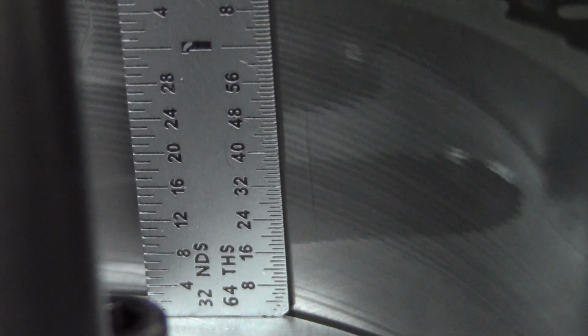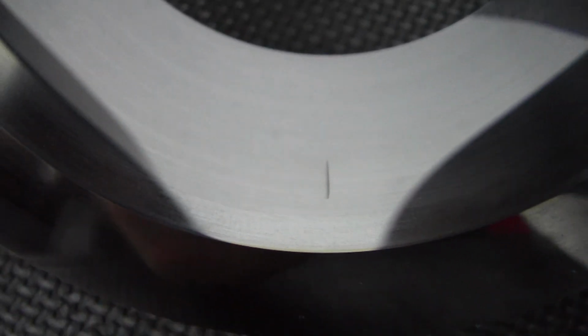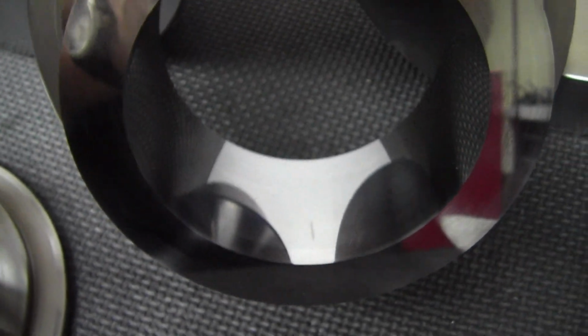This is pretty rare. That's an actual crack in the D2, a flaw in the material. And what you're seeing is the magnetic action going on around that crack is actually causing the D2 particles that have been abraded off to lay across the joint. Here it is cleaned, and you can see that crack in the polished parts.